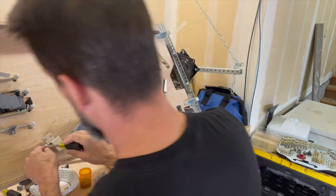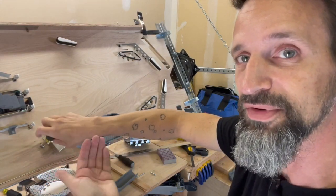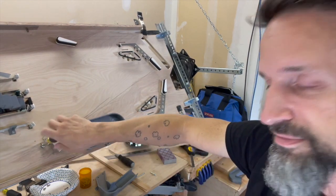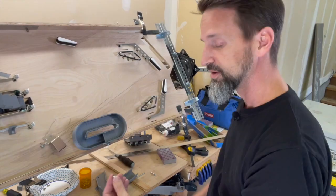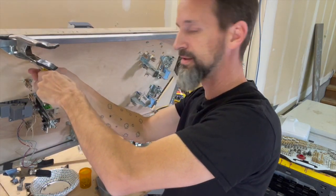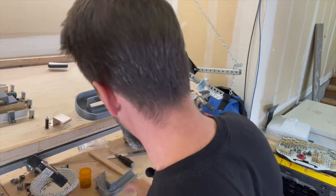So, using our 1/4 inch nut driver, we're going to get that guy screwed in place. Now, normally we'd have a T-nut on the bottom side of the playfield that this would be screwing into. I haven't gone through and routed out and made recesses yet for the T-nuts. That's going to be a later, more final stage of playfield build. So we've got a nylon locking nut. There we go. That's a number 8. There. So that's nice and secure. We can put that little protector on.